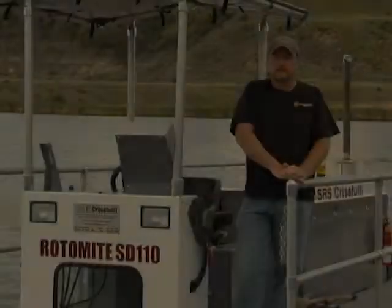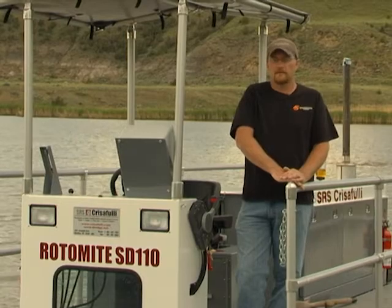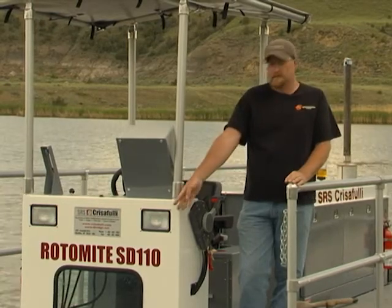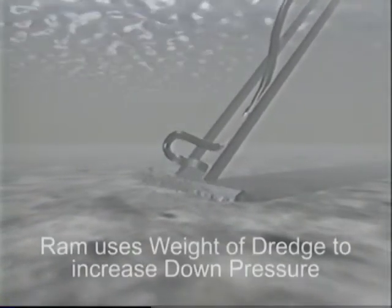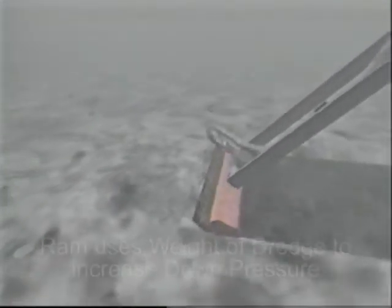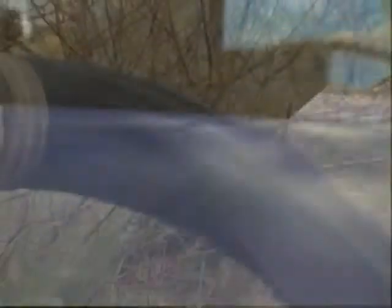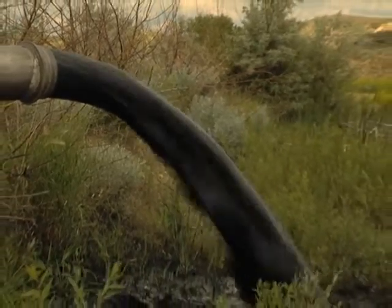You can see the sight bottles in the rear. In an environmentally sensitive area, we can use a food grade hydraulic oil to operate our cutterhead and our pump. We're able to use hydraulic rams to drive it into the material, and that's a huge advantage. When you really get into some tough stuff, that added pressure makes a world of difference on concentrations you're pumping.